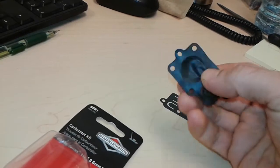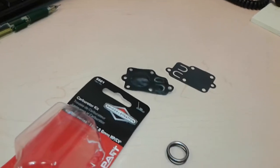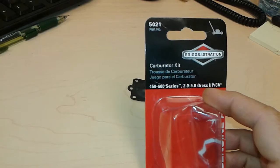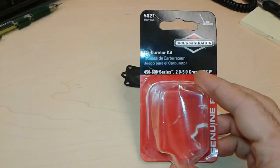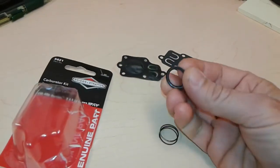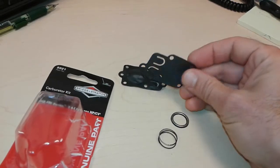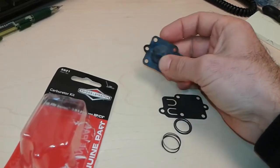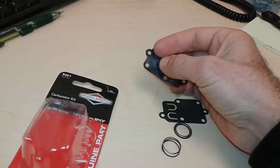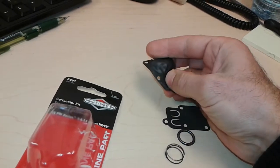When I saw this I knew I needed a brand new diaphragm. You can buy a kit at your local hardware store or online. This kit came with a protecting washer, a spring, and a brand new diaphragm. You might also notice a torn diaphragm — this one wasn't torn, they're pretty strong material, but it was lacking the flexibility to do the job.